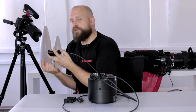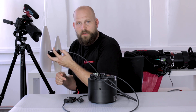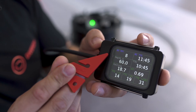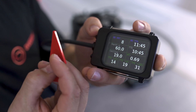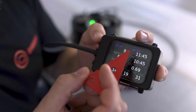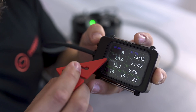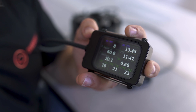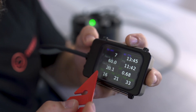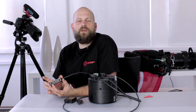The next screen is the TTS screen, which shows information about our remaining times based on the bailout we carry and have preset into our unit. Over here is our bailout remaining time — the time we have left on our bailout. The unit notifies you when you reach the point where you have just enough bailout to return to the surface. This screen also shows our total time to surface on bailout, our current depth, current ceiling, and partial pressure of oxygen. If we want to know how much our total time to surface would change by extending bottom time by two, five, or ten minutes, we can see that information in the boxes below. If you don't want to see any of those pages, you can turn them off in the menu.